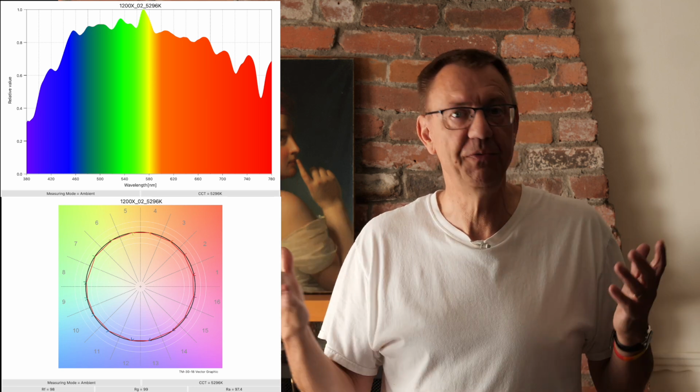Now, in terms of daylight, as Tim Kang was talking to John, he mentioned that daylight is not a perfect light in terms of what we're used to with our Planckian curves and our green-magenta. When I metered the sun direct outside at about 10:30 in the morning, it was 5,300 Kelvin, but it also required about an eighth magenta to get it back to zero. We know that daylight is all over the place, and that's why you want a tunable white unit, not just something locked to 5,600 or 6,500 or whatever it is. You want something that is tunable.